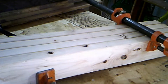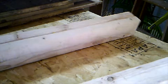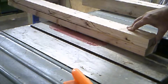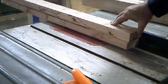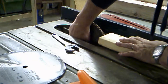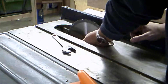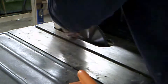I'm going to be using dimensional lumber because it's relatively cheap and very accessible, but we don't want our tables to look like dimensional lumber so we will do some trimming. I've glued together the first couple legs — two by fours always come with that rounded corner and we want to cut those off for a nice square leg. The blade was a little dull so we changed it. There's nothing like a new titanium carbide tip blade; you want at least 80 teeth on the blade for a nice clean finish.